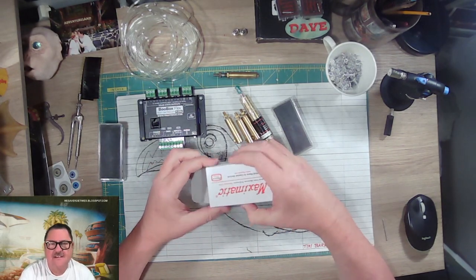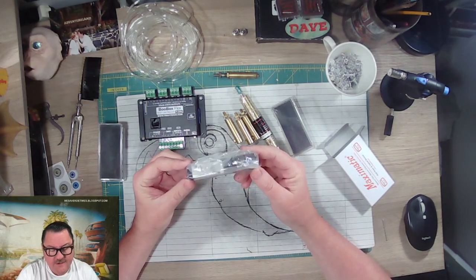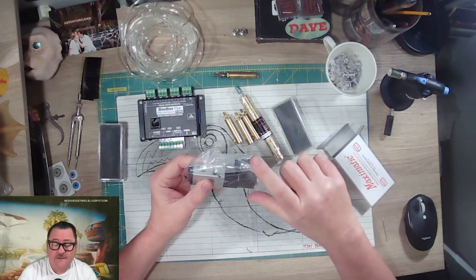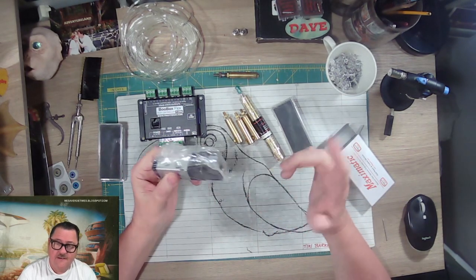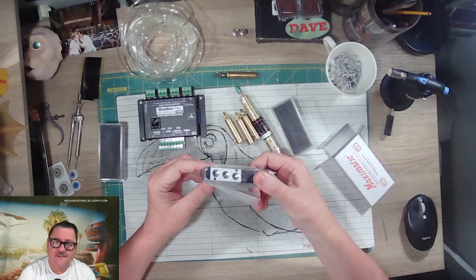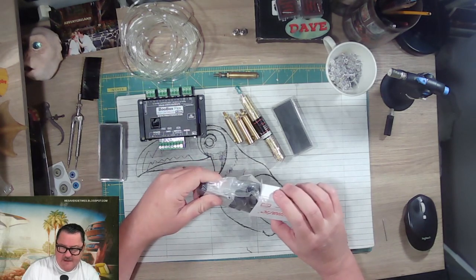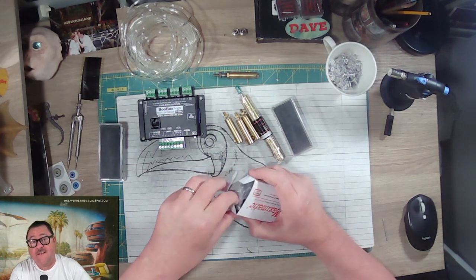This solenoid valve — it's a little big and not period-accurate, but it'll work. This is your electromagnet slash solenoid valve. When power goes in from the controller, it channels the air in or out. With a cylinder like these you'd plug one port as an input and have the other as an exhaust. Each function gets one of these, so I have all of these ready, along with the manifold that fits on.